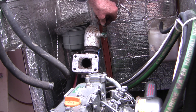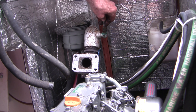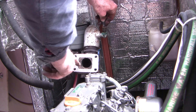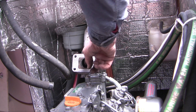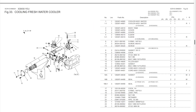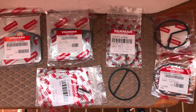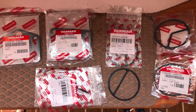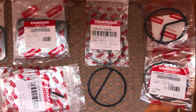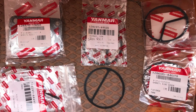Here I'm doing a little screening test to verify that the exhaust elbow hasn't rusted through. I'm siphoning water from above and then looking for water dripping back the wrong way. It passed. For those of you with the same YEU engine assembled in Europe, here are the parts I ordered and used. Yanmar went through some iterations in the design of their heat exchanger and some have a V-shaped gasket — that's not the one you want if you have my engine; you want the one shown beside it here.